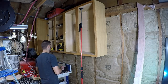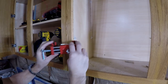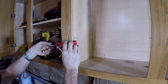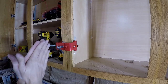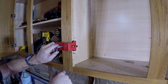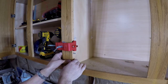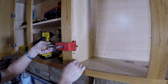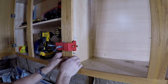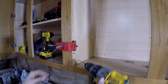Here's the red clamp — it just hooks right over the face frames and you start tightening it up loosely so they're barely touching. We're going to tighten this one in, starting to line them up, and snug it down. Just give the frames a little push and cinch them down. No need to go overboard — the screws are really going to suck these together.